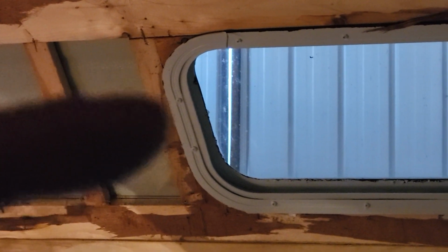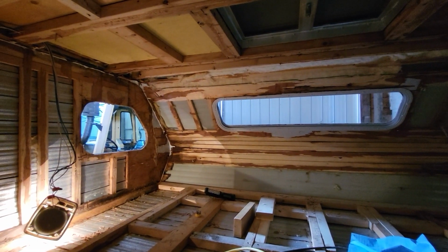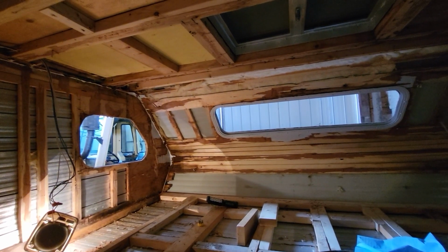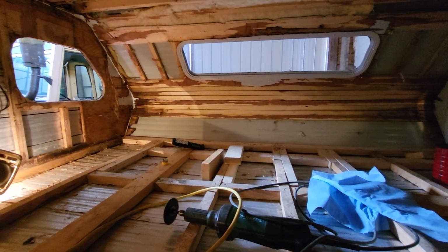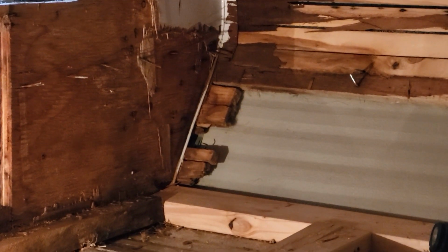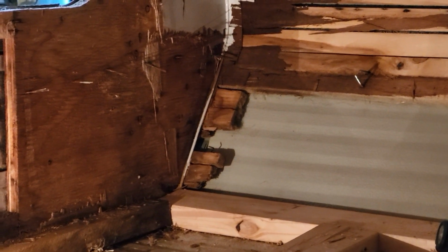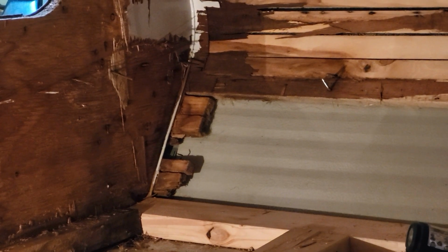I'm building a box on all the windows that goes basically 1/8 of an inch clearance on this side all the way around so that I can build the rest of the walls out to 2 inches before sheeting. So yeah, I got that cut. I'm essentially just trying to zip those pieces off that are hanging out there that were part of the other studs that were below the other ones. I'm going to zip those off as close to the wall as I can.